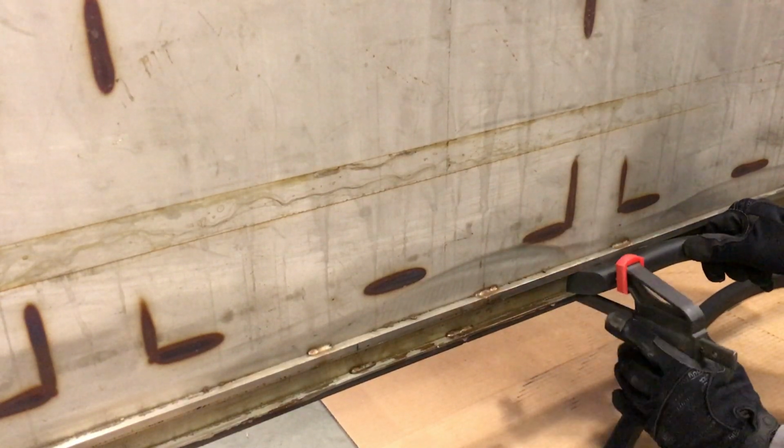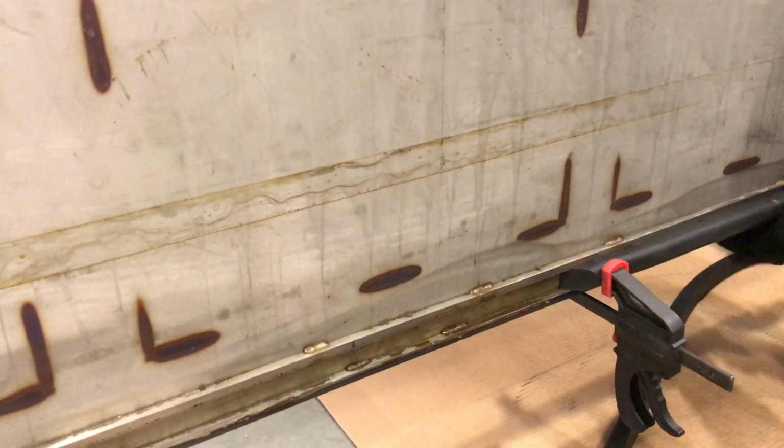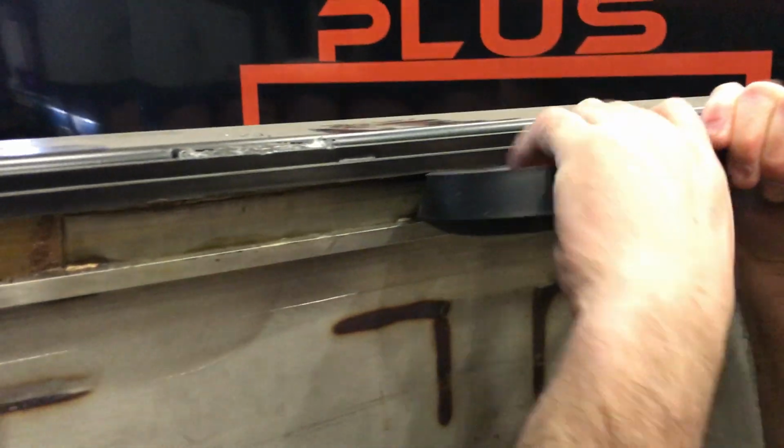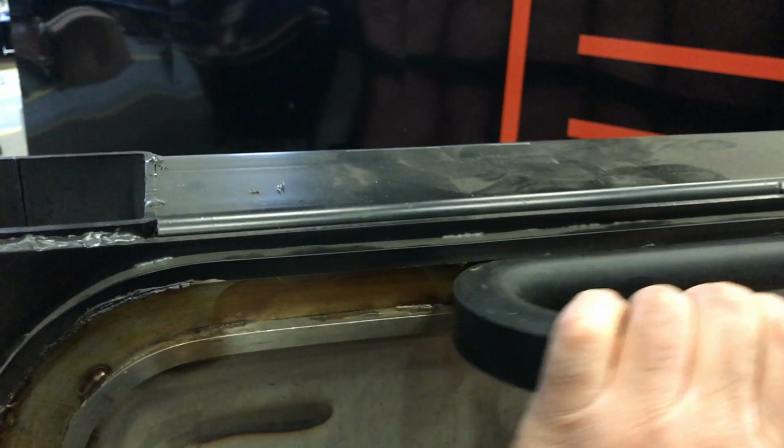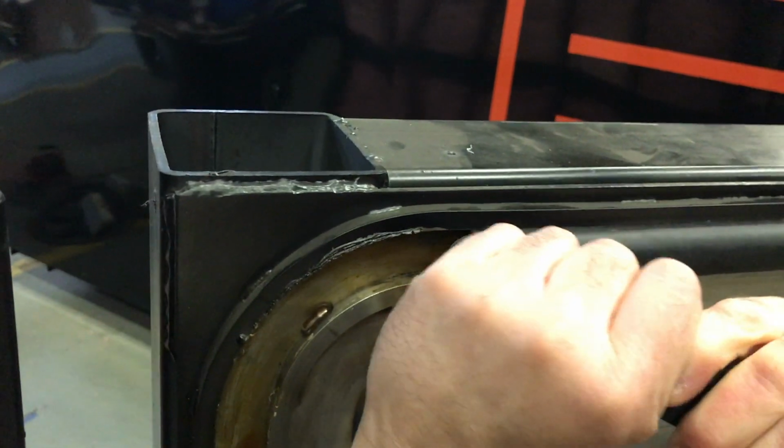One end of your new gasket has a 45-degree cut. Use that end to clamp in place, starting at the bottom of the kiln. A great technique is to bend the gasket back on itself and roll it in. Sometimes you just need a bigger hammer.